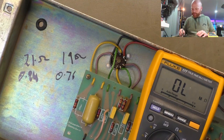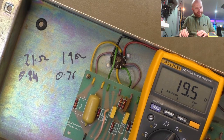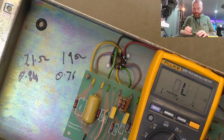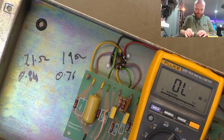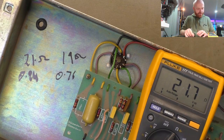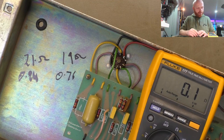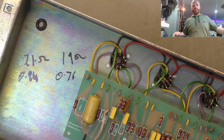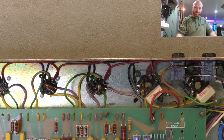On the right hand side measuring 19.5 ohms - wait, this is measuring 0.1 ohm - close enough. On the other side, 21.7 ohms, so a bit out. You'll probably find that when this amp heats up those resistances will raise somewhat, so you should test it with a pretty warm amp because that's where they spend the majority of their operating life.